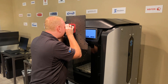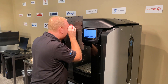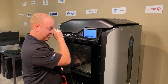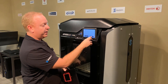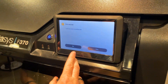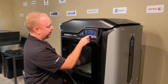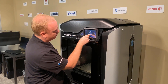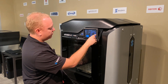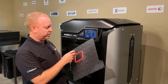Start at 0, go up and down, and find the offsets to work with. The screen will ask if we're ready for another print job because we opened the door. I'm not putting in a new tray yet, so I'm going to say no. We're back to our calibration screen. The print is pretty darn close, so I'm just going to move the X1 a little bit and the X2 a little bit — it was just slightly off, so I'm only moving it to about negative 1.